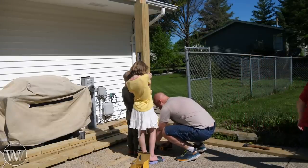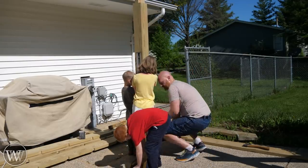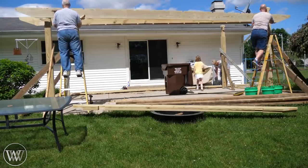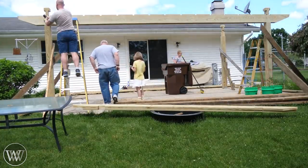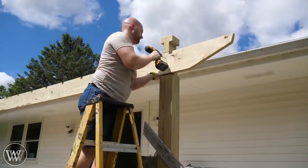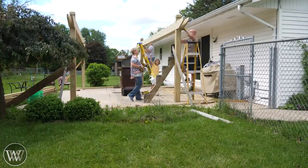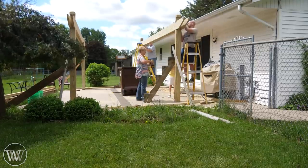Now for the next part, I need to actually put in these 24-foot-long beams. I wasn't about to have the kids help me with that because these are each probably around 150–200 pounds apiece — they're heavy. Those go into the joint and we're going to put two screws into them temporarily until I come back and put bolts in. There's one of these on either side of the 6x6. I cut the gap a little bit too big, so I'm going to be filling that in with another piece here in a little while.